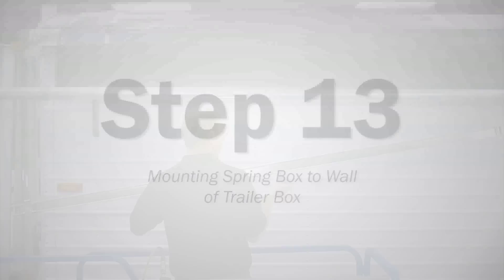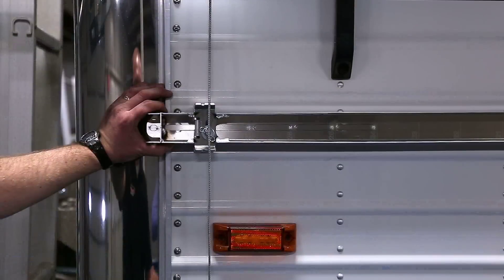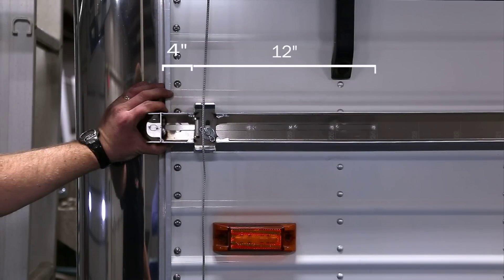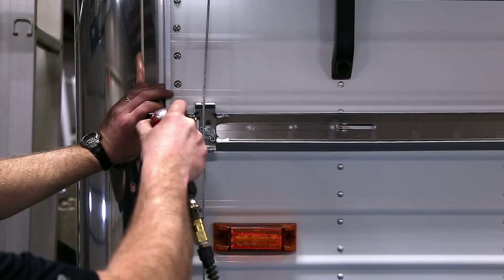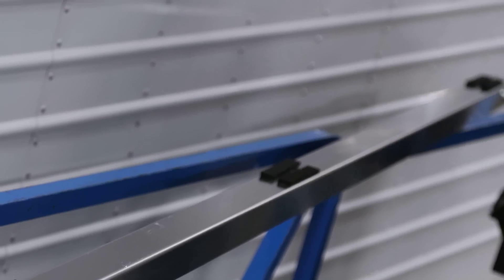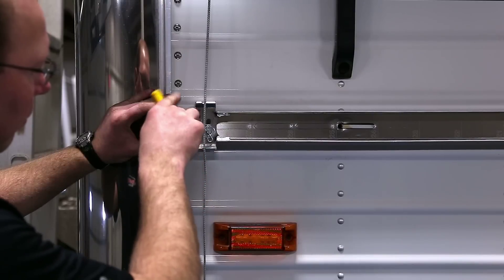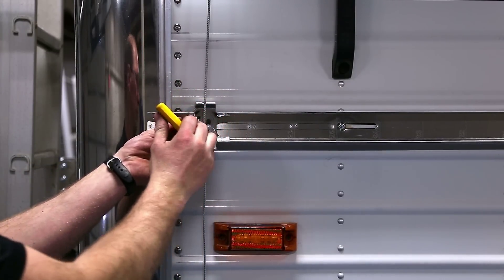Step 13. Position the spring box ten to fourteen inches down from the roll tube, clear of any interference. Orientate the spring box so the pulley end is at the same end as the driveline cord. Align the notches on the spring box with the cord hanging straight down. Refer to the instructional manual to determine hole placement. Knock out the slotted slugs, mark hole locations and drill 5/16-inch holes in each marked location. On the back side of the spring box, apply adhesive foam strip, one on the top and one on the bottom of each bolting location. Realign the spring box with the holes. Use a self-drilling bolt to cut threads for button head bolts in all four locations, starting bolts with a 7/32-inch Allen wrench. Then, with the notches in line with the cord, tighten the bolts.